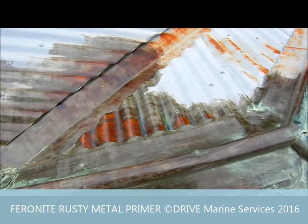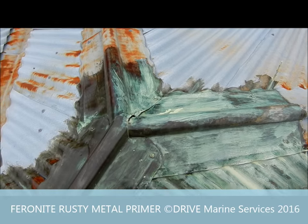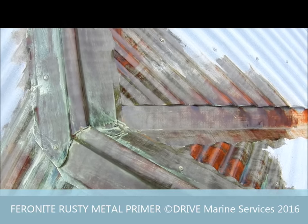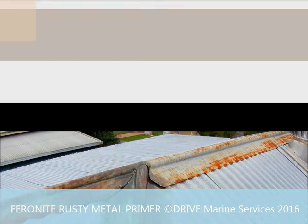Coated in this area. Notice how some of it's dry and some of it's still a bit wet. Actually, in clement weather where it's cloudy and no rain is the ideal time to put it on, because it slows it down going off and gives it more time to react and convert before it dries.